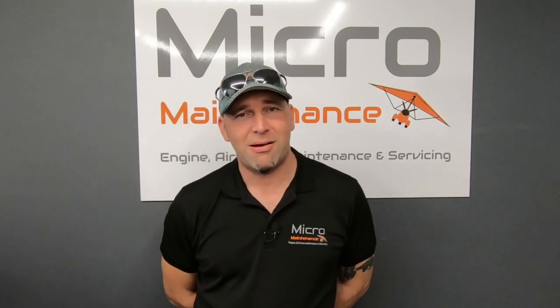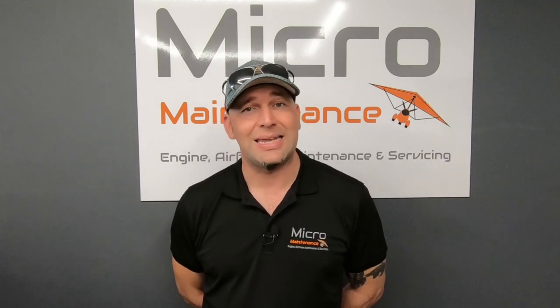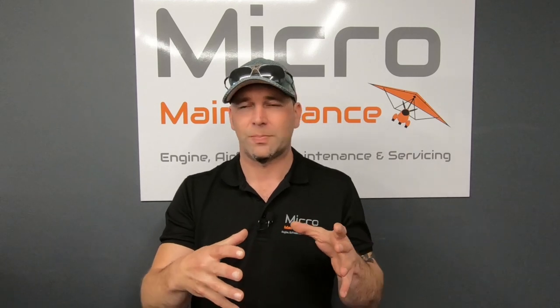On this particular aircraft, we fitted the Class 2 transponder, the TT21. We also fitted the TN72 GPS positioning system, and we used the TA50 internal bug to provide a GPS system for the ADS-B out. We also fitted a Pilot Aware system, which included the internal antenna kit. And we tend to use these in a Flexwing situation because we can really make it a nice, compact install.